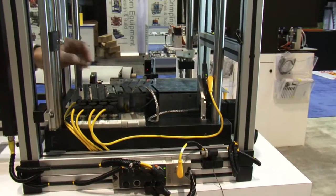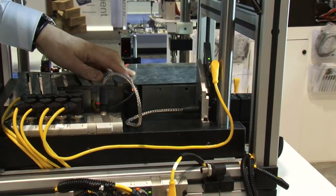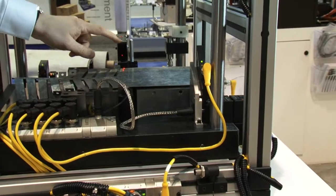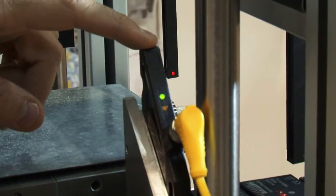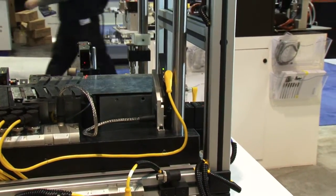On this part of the tool, we're demonstrating feed sensors. You can see a proximity sensor detecting proper feed on the tool. Over here is a photoelectric sensor detecting proper feed if you don't have room for a prox, and down here we have a photo-eye with a special angle shape to detect the feed as it comes into the press.